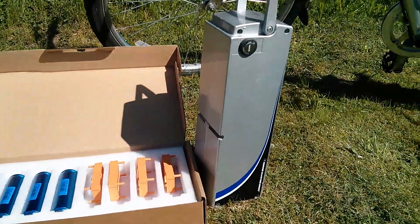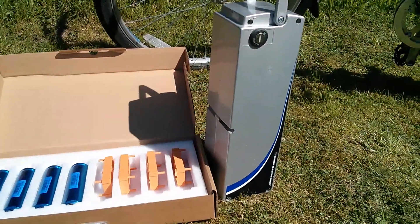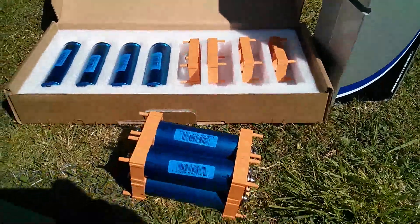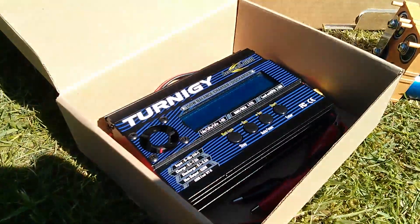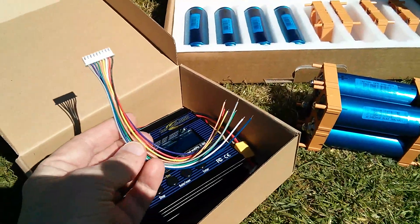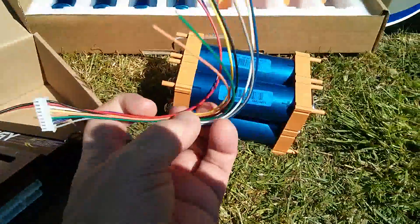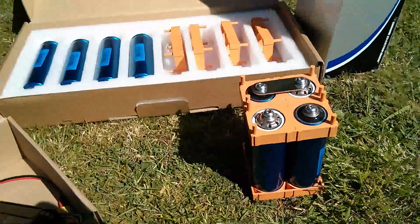The bike was supplied with a simple charger for the lead acid packs. I noticed a few months ago that that had failed, so I can't really charge this pack anymore. For charging the lithium iron phosphate cells I'm going to use this — it's the Turnigy AccuCell 8150 8-cell charger. You'll need a balance charging lead, something like this, which plugs into the balance ports on the side of the AccuCell, and then these wires connect to all the various cell connection points on the pack.